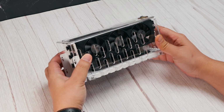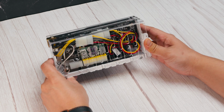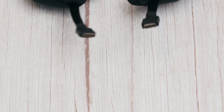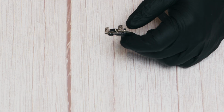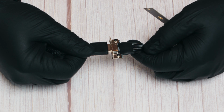With the recent rise in Oculink-based external PCIe solutions, I thought it would be a fitting sequel to showcase an Oculink-based mini eGPU using a standard low-profile graphics card, making it a more practical solution for a wider range of users. For those unfamiliar, Oculink is a PCIe-based external connectivity protocol similar to Thunderbolt, allowing PCIe devices like GPUs or capture cards to connect externally to a computer.